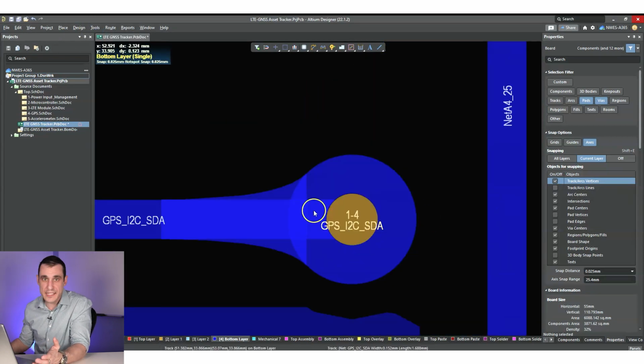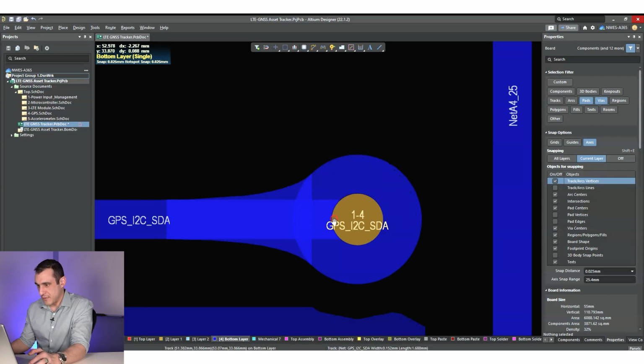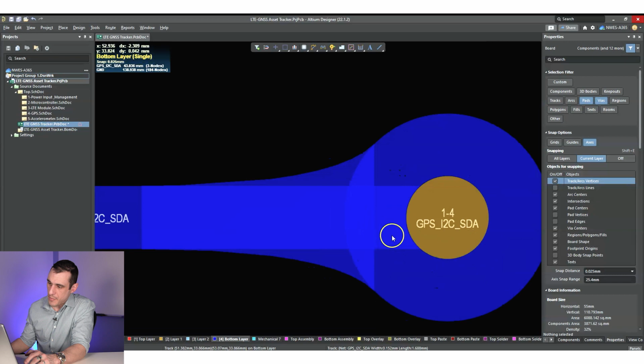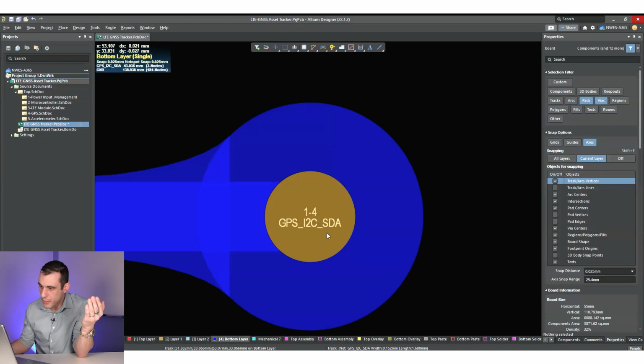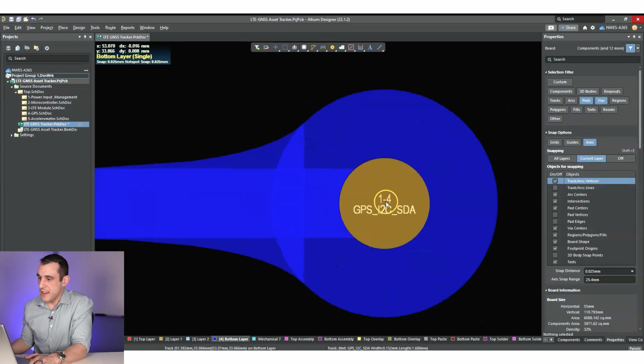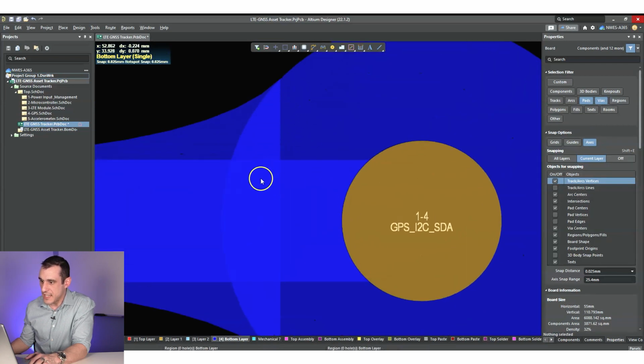We want to ask, is this big enough? The answer to whether it's large enough depends on how much of an annular ring we are going to expect if this drill is off from dead center in this pad. Obviously, in the manufacturing process, it's not perfect. There's going to be some wander in this drill hit. It could hit anywhere inside of this pad. Ideally, you size the pad to be large enough to accommodate any of that wander and still leave a leftover annular ring around the edge of the pad. So let's say for a moment that the drill hit is right here along this edge.